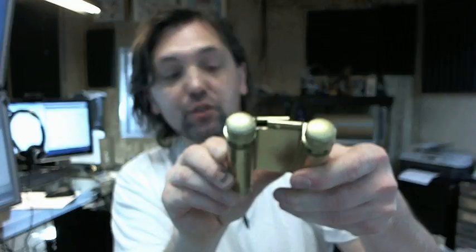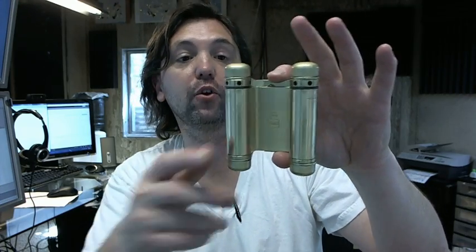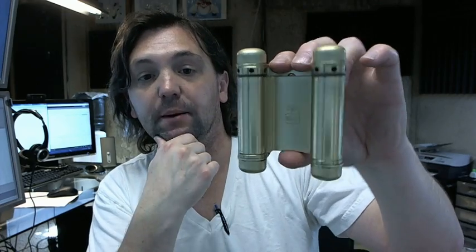The dash three is representative of the size, which you can see in the link called template. It is really not a dimension that you can take off of this hinge. The three inch reference is actually a reference to how thick of a door this hinge is made to accommodate, and we'll talk about that more in a moment. The 633 refers to the finish, and that would be the satin brass finish.